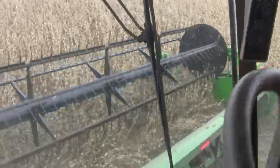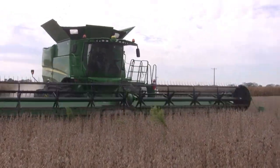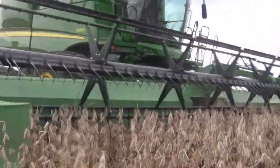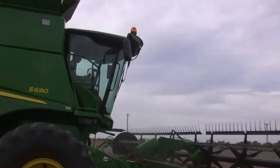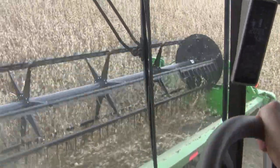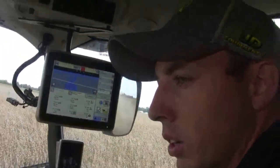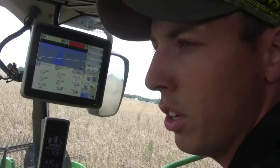You can see on the camera the advantages this draper head has, but tell me from your vantage point some of the things it does against the competition. When you look at a John Deere draper head from the cab, sitting comfortable in your seat, you look right down and you see that belt, you see the knife — everything's right there visible for you, so you can see that product being fed in. Comparing this to conventional heads with augers on them, you don't see any wrapping going on. That's really beneficial when you get into some weed pressure or really thick beans that might get tough on you throughout the afternoon, and they'll feed more evenly. When you feed more evenly, you use less horsepower, which means you use less fuel.